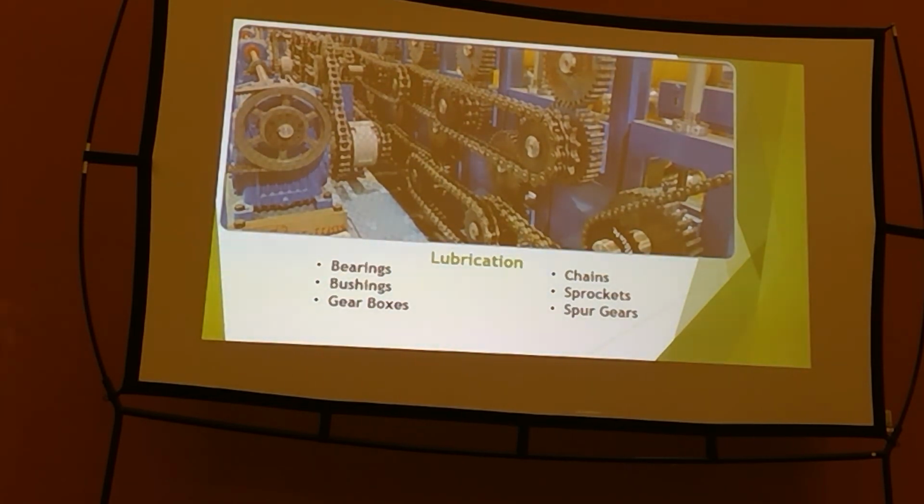If you let those chains get super loose and worn because they haven't broke, that doesn't mean anything. It doesn't help you, because you're gonna wear your spur gears out faster because your chains have chatter in them. If you have chatter in the chain, you get chatter in the spur gear, that transfers to chatter in the roll tooling. You're gonna start seeing those little shiny marks on your roll tooling. You're gonna start seeing a radius on your panel that has that staggered look to it. You can see it. It's not super defined, but it wears out your roll tooling faster. It messes up your radiuses.